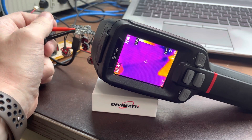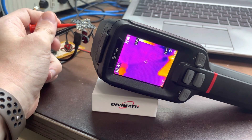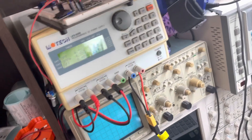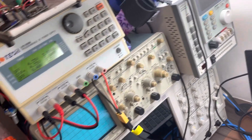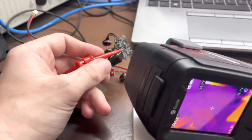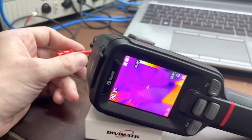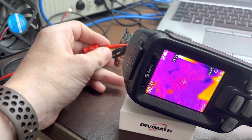Just like before, I've had a busted FET getting hot under current-limiting load. For some reason, after staying on power for a little while and letting it cool, it will just start working again. So I thought I'd do the same thing. When this power supply detects a short, it goes from voltage limit to current limit. Right now I have it set to 3 amps, so it just sends 3 amps but lowers the voltage to like 2.3 volts, so it doesn't overload the circuits.